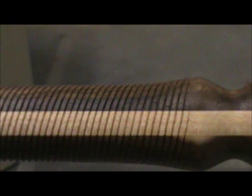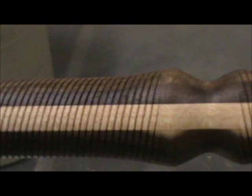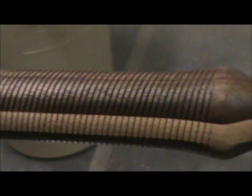I've gotten it sanded all the way down to 600 grit, then I cleaned it up with some mineral spirits to get all the dust off. On this particular piece I'm going to use a polyurethane for the finish — high gloss. I normally use high-speed friction polish, but with these spirals you can't put friction polish on with a paper towel because they get stuck in the little grooves and it doesn't look very nice. So I'm going to put three or four coats of polyurethane.